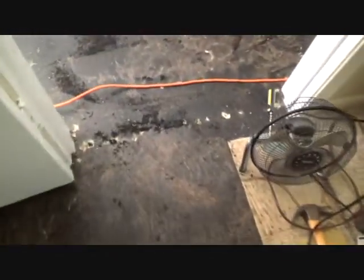You see, I first scraped all this, and all this has been scraped one time over, up to here. And I did all this with my small hand scraper, but then I went back from this point right here on back that way. I've already done that, and I got a little bit extra off and softened it up a little bit more. You can see the line where I've stopped right there.